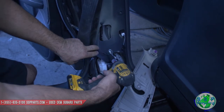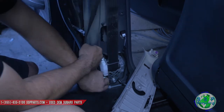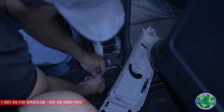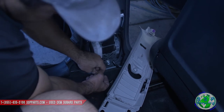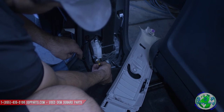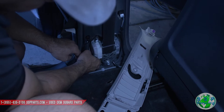If you do it a couple times, this gun will snap the bolt, then you've got a big problem. Make sure that this yellow pin is out when you plug it in, and make sure that this goes in all the way flush.